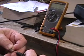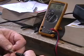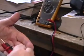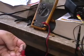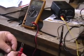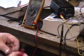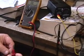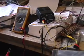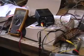See if we can get a steady reading on there. There we go, 183 ohms, which for a capacitor would drive the flip-flop crazy, but isn't immediately obvious because there's a resistor across it. So you kind of wonder about something like that. And this is supposed to be an 005, but it's actually quite bad, if you must know. It knocked out the other oscillators in the previous card as well.